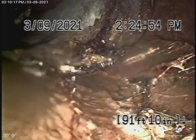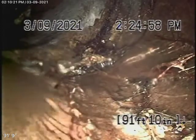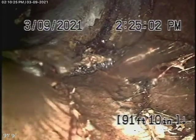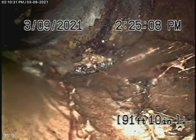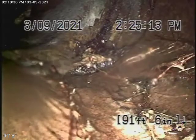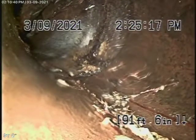You can pretty much see all the plumbing overhead. We're here to check the main sewer line and right now we have our camera in. At the 3-inch clean-out, we're all the way at the city connection — just before the city connection. It's a little dislocated over here right at the end. There's a little bit of roots getting in. You can see right around the corner there is the city connection.